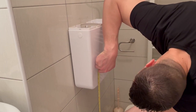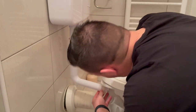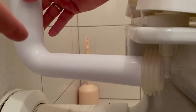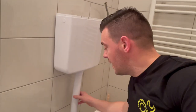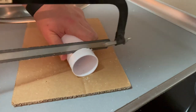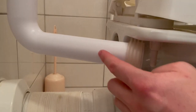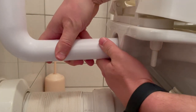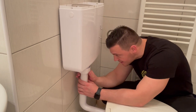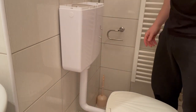Let's mount this new water tank on the existing railing. I will measure if everything is in the same line — yeah, pretty good. Next up is this new outgoing water pipe. Put it in there and, as you can see, this pipe should be on the same level as this hole right here. Right now I won't get a straight line to this hole in the toilet. What we need to do is take this pipe and shorten this side of the pipe for the amount we are missing. With the slightly shorter pipe this is much better — the hole is almost at the level of this pipe. We will insert this pipe right in here and then assemble the water tank above it.